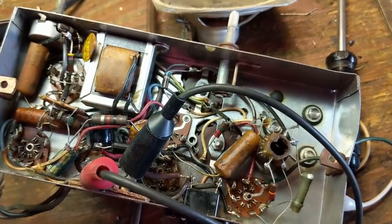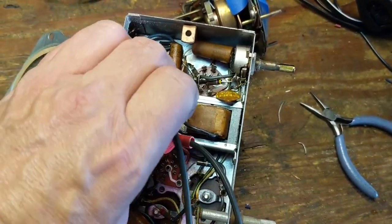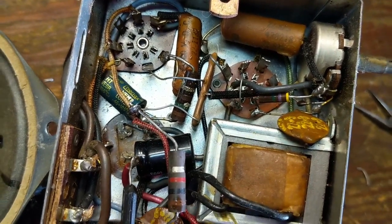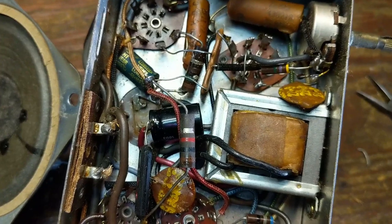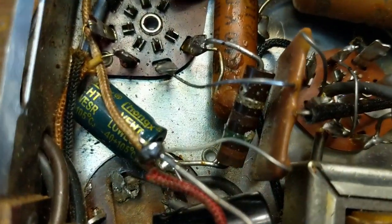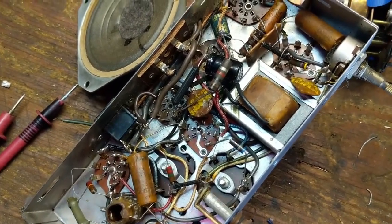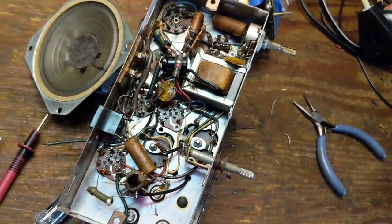That means a couple of things could be happening — either we've got a hosed resistor, I haven't really measured my B+ voltages, or one of the tubes is bad. I usually start with tubes first because that's the easiest most obvious thing, then work back from there. I tested all my tubes and it's still not working. What started happening was that resistor started to get pretty hot. I think we're dealing with a shorted cap because I've measured B+ — one was a little bit low, one was okay. I'm suspicious of this cap right here — the end of it is bulging out. It'd be quicker just to replace the remaining caps instead of testing, so I'm just going to go for it.